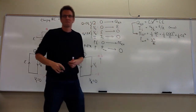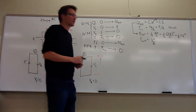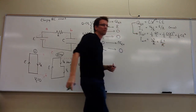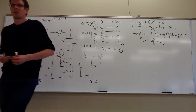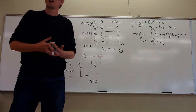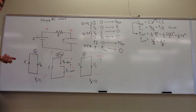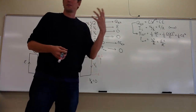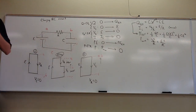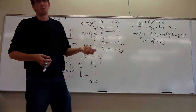At the beginning, you're dissipating the most energy through the resistor. As you progressively charge, eventually the capacitor fills up and hogs all the voltage drop — it has the most charge and most energy stored. Then that's all the battery can do. This is the maximum that battery can put on that capacitor, because the current eventually goes to zero and nothing more is happening.